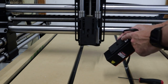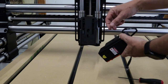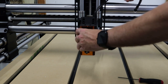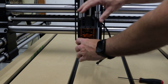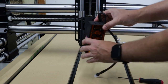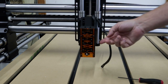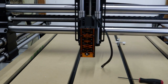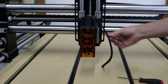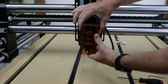On the 24 watt and other lasers, there's going to be keyed tabs on the back screws that hold into the line-up and hold into the mount. These can be loosened or tightened depending on how you want it to sit on the mount. If you loosen them all the way you'll hit the keys and it will suck down — you can feel it suck down and it won't be super tight. You can tighten these just slightly so that they'll fit into the keyhole, then push down, and not only is it going to be in the keyhole tightly, but the magnets will be hitting it in, so it'll be nice and secure. If you want to get it even more secure, you can take an additional Allen key and tighten it into the back a little bit more. It is pretty sturdy and you can see by trying to get it off that it's really hard to get off as well.